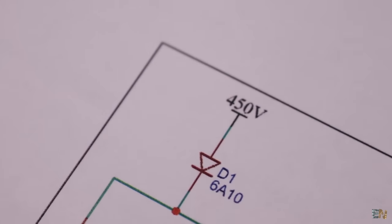So I soldered the next stages as I did with the first ones, the resistors, the thyristors, and the coils. So now I have 5 stages, so we can make another test. And as you can see, if I rotate the tube, each of the red LEDs will turn on, because we have a pair of infrared LEDs and a phototransistor for each hole. You could also add some hot glue to keep the LEDs in place if you want.